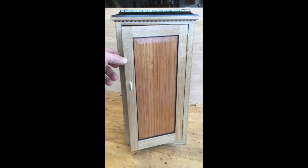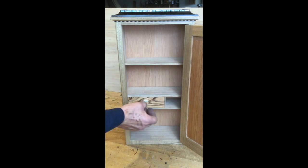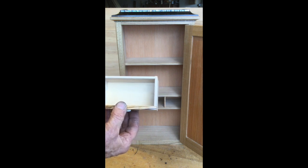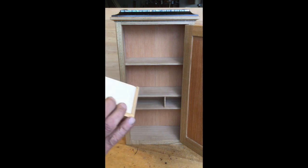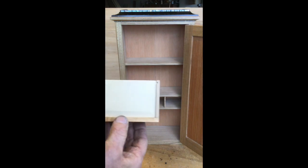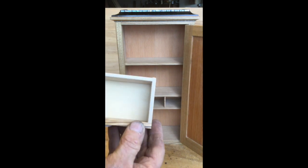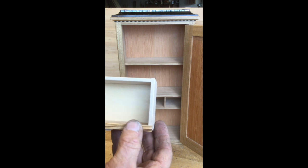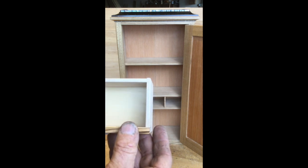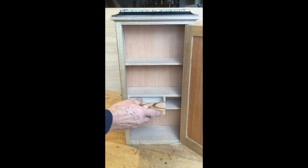And then inside you've got a little drawer, a little olive drawer, and that has got an Engelman spruce bottom. It's got sycamore sides with dovetails, obviously. You can see a little raised bottom all the way around. And then this little joint at the back, which is very good for just having a back as far back in the drawer as possible — just a pressure-fit little tongue and groove. With some end grain glue in there, it actually is pretty good.